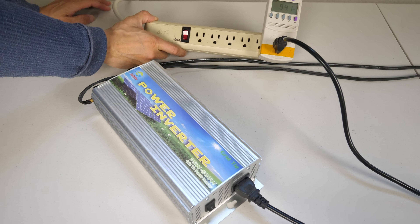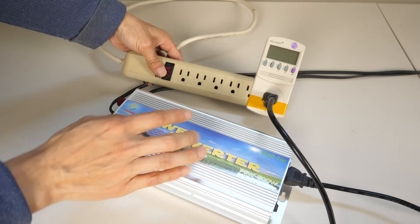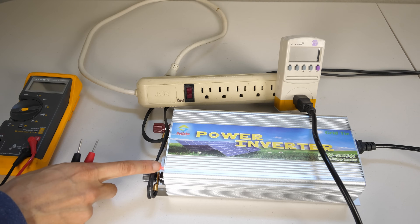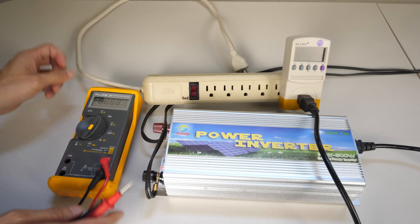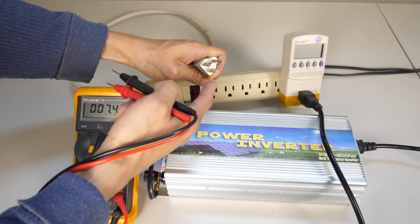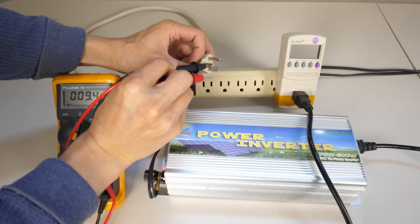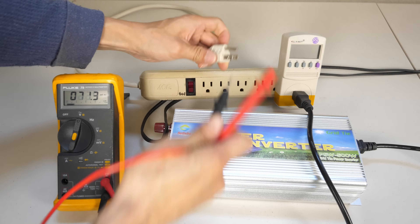So now I'm going to do a test. I'm going to unplug this power strip from my wall over here — and you can see it turns off. So therefore this thing is actually not feeding 110 volts back. Let me double check with a volt meter. Right here it's red indicating something is wrong, which really is that the AC is not plugged into the wall. If I turn this on to AC, this represents a power line worker disconnecting the electricity, so this should be dead right now. Technically you'd think the solar cells are injecting power, but if you measure it, you see it's not feeding power back into the grid because it is disconnected.